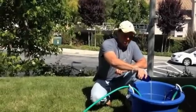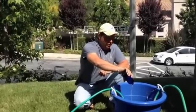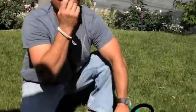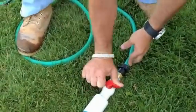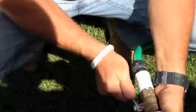We're going to add that and the pump is going to keep pumping it through. You want to let this keep going for about an hour. So after an hour has gone by with it completely running and the pipe completely sealed, we have our pressure gauge here and our valve all the way down at the other end. We're going to shut the return valve back to the pump.